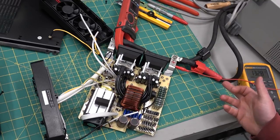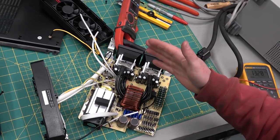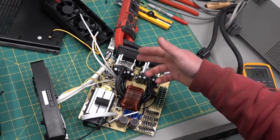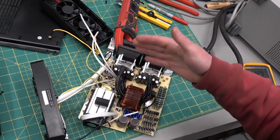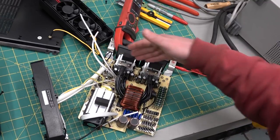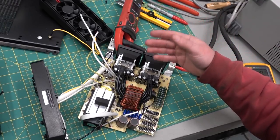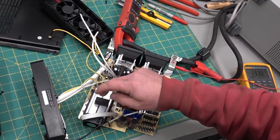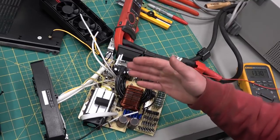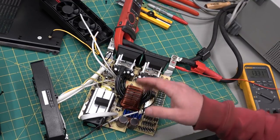Charging up the very robust lead-acid battery — it was a little low but we're trickling in at three amperes. If you've watched Afrotech Mods or Great Scott make their own inverter, you'll know that a lot of times the configuration for simpler inverters is a push-pull. Well, it could still be a push-pull configuration, but all of the MOSFETs on the input stage are all the same — they're not an N-channel and a P-channel. The easy way to make push-pull is with two opposing MOSFETs. In this case, on the output it's the same — they're all the same MOSFETs. That leads me to believe this is an H-bridge, though I'm not quite sure — it could be a slightly different topology.